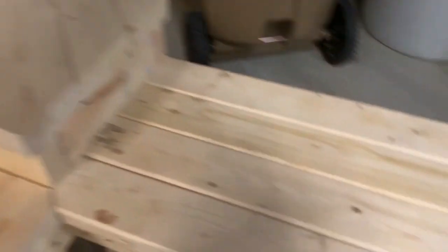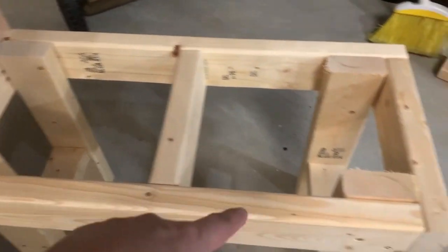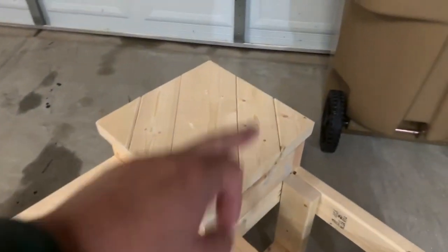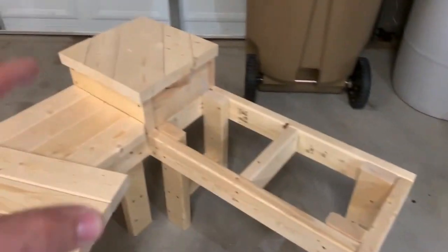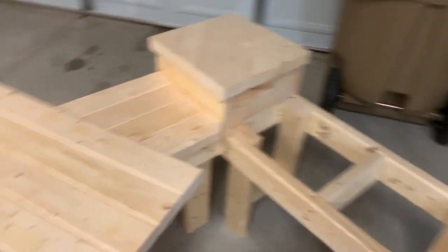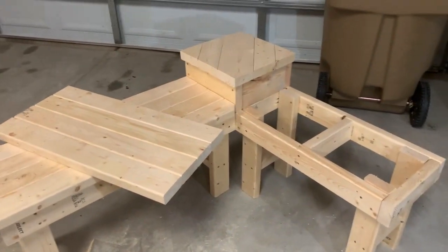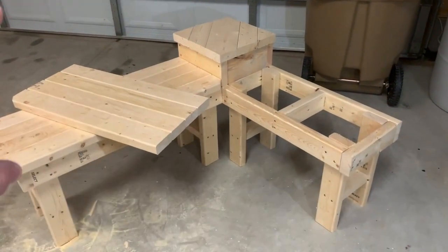So what I'm going to do is remove this, put some pocket holes right here, here, here, and here — so I'm going to have multiple pocket holes for each connection. I'm going to flip this over, drill out some pocket holes, stand it up, then flip it upside down and screw it together, because I don't want to see screws on the seats themselves. I'm going to do some pocket holes that will hold the seats down, and that way we can sand this whole thing up, get it all sanded, then stain it, and it will be done. This project will be completed.